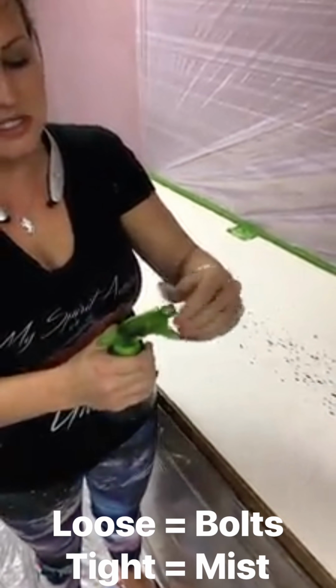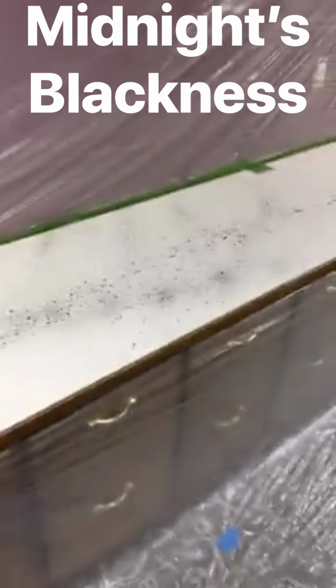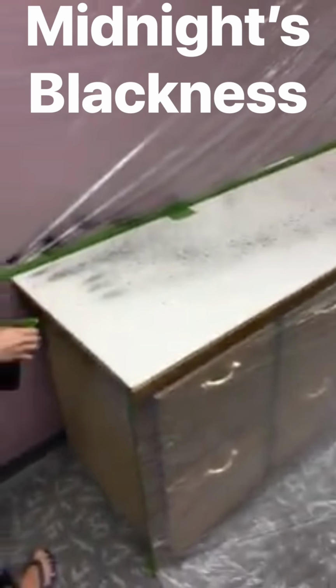So we're gonna start this project with a little mist down onto our countertops. You're going to want to spray in a direction. Now, natural stone grows in a pattern, kind of smears like this, because it's made out of minerals and things that flow together. Make sure that you maintain an organic flow by always spraying in an angled position, allowing the UNiCORN SPiT to land like it's flowing, shooting out.